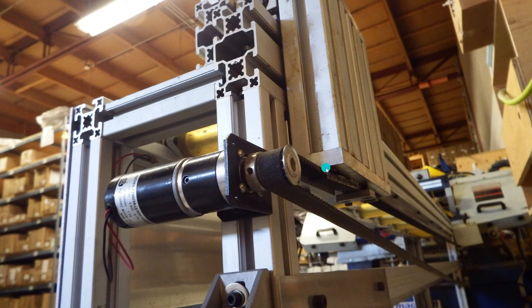We also see the motor that drives the belt back and forth on the shuttle. I expected the side load on this little gearbox to destroy the motor immediately. Ideally, we'd have a shaft supported by two bearings to handle the tension from the belt and then couple the motor into that shaft — but seven years later, we're still waiting for the gearbox to fail. At the heart of this entire system is the linear encoder. Having five micron position resolution makes it possible for us to offer low-cost custom cutting to our customers with submillimeter precision.